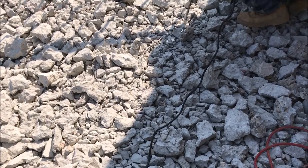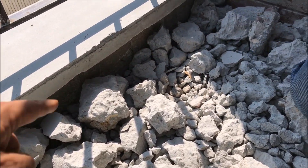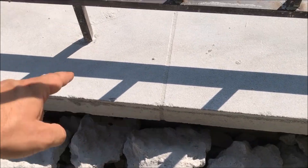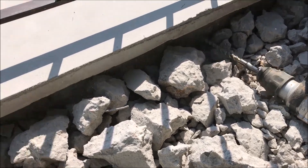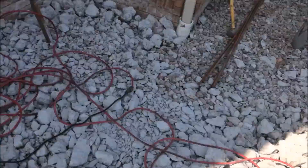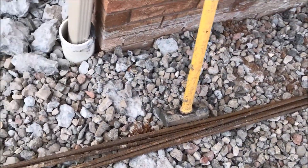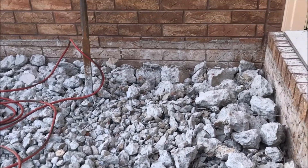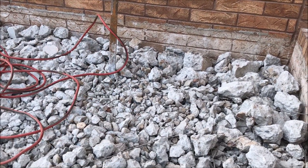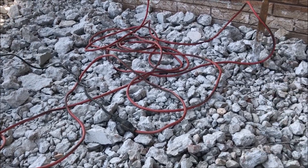So we're gonna bust it out and see what we have. Now that we have all the cement broken out, we're drilling in the rebar. You put one there, one here, two, and then three over here. That's good — to give the rebar something to grab. This rebar is half inch. We're not going to drill anything into here because this is just a brick facade with wood behind it, so we're not going to drill into that. Down this way you'll still get the same effect — it won't crack.